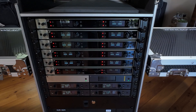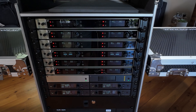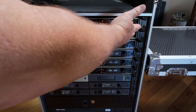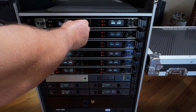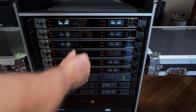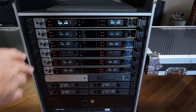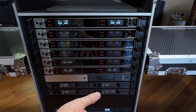In the first part of the rack we have 24 channels of Sennheiser EWDX UHF receivers. These units are so easy to use. Every module has four channels of receiver, with individual control over every receiver right down to every parameter, including overriding any mute settings on the individual body pack transmitters. 24 channels of digital rock solid reception.